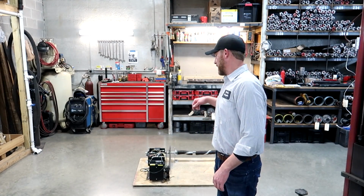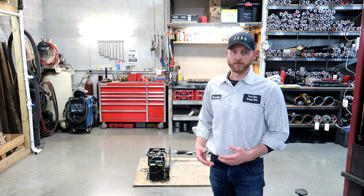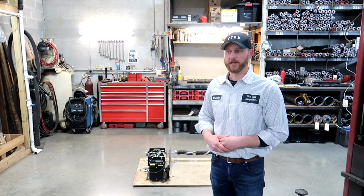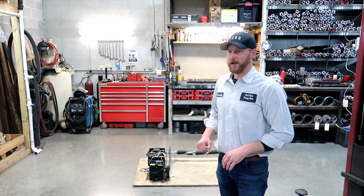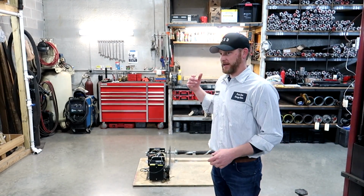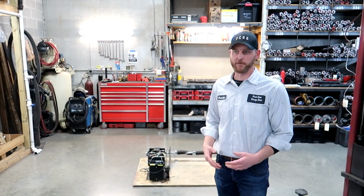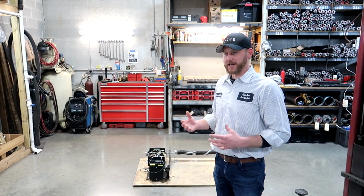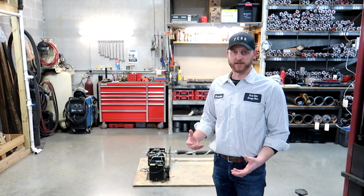Number two, when I say these operators will tear up a smaller door, it's not under normal circumstances. If the springs are good, cables are on, everything's running normally, it's perfectly fine. It's not going to destroy your door, no way, shape, form. It's when you break a spring or you break both springs, or somebody hits the door and pops a cable off of it, or the door closes on something, pops a cable, whatever the case. This operator will then destroy your door. It's not going to stop, it's going to keep going.